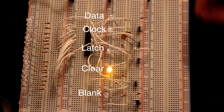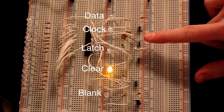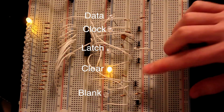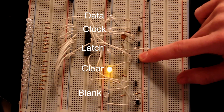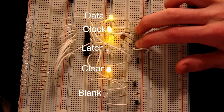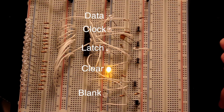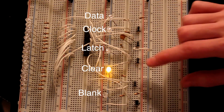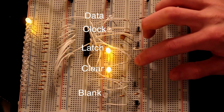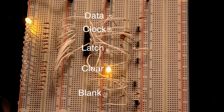You can do cool things with this setup — like proving whether it's truly the rising edge of the clock line that shifts data in. We know that shifts in a one; let me reset that. Is it truly the rising edge? If the clock is already high and I do things with the data line, does the falling edge shift any data in? After latching, of course nothing is there — because it is truly the rising edge that shifts data to the outputs.